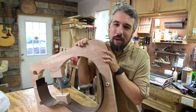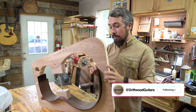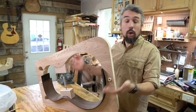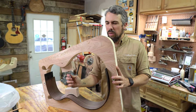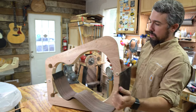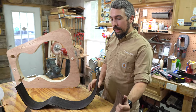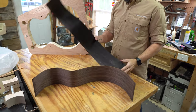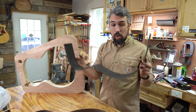Welcome to episode number eight of the three-thousand-year-old guitar build. As you saw in the previous episode, we went ahead and bent up the sides and discussed the concept of conservation of energy. These hips just sat overnight to help them maintain their shape. We have our Indian rosewood laminate piece, which is 80 thousandths or two millimeters thick, and then we have our ebony side, which is our exterior piece at a full thickness of two and a quarter millimeters.